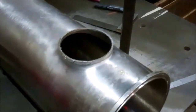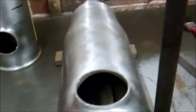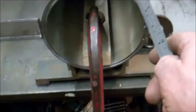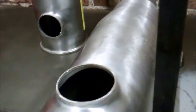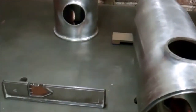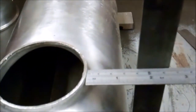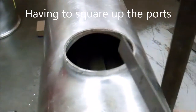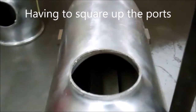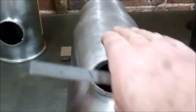Got the valves cut off. Cut them off by hand, so they're not true at the moment. I've got the body of the filter clamped down and mounted on a surface table which is level and flat. I've centralised this opening - 39mm from each side - so that is at the top. And now I've got to grind that until it's level in both directions.